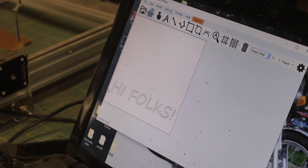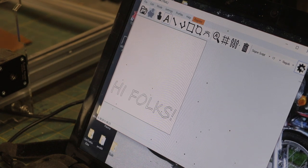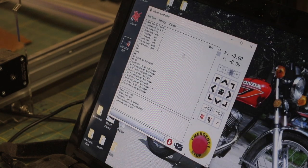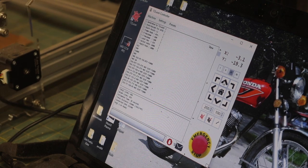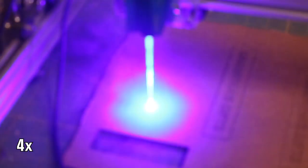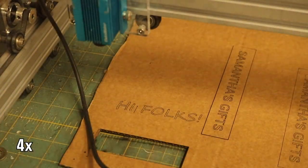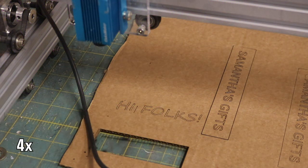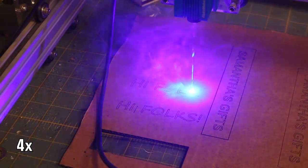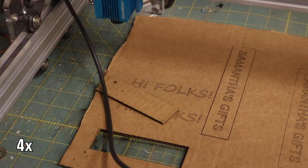If you really enjoy using the machine, it's worth it, I think, because it allows you full functionality. It's kind of like a CAD and a CAM and a G-code sender all in one. This program not only allowed me to really dial in as far as power and feed settings with the machine — which is like a whole new thing with a laser, I'm only starting to get that with metal cutting machines, my milling machine and stuff. With a laser it's a whole different playing field. And I can also get a feel for different kinds of cutting strategies, like this trace pattern which I kind of prefer for a lot of things, but then there's the scan line style for rasterized images when you want to do more of a dot matrix setup.